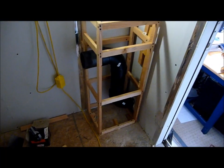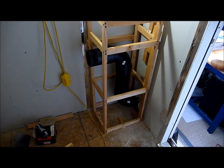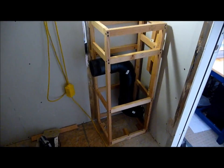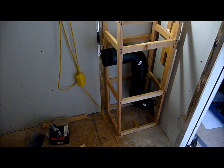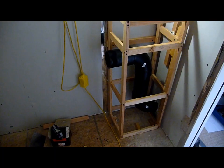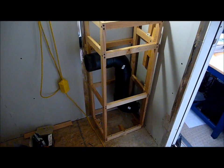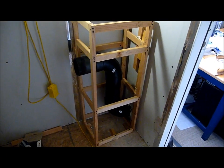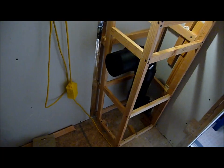So what I've done here is I've taken some 4-inch PVC pipe, fed it through the wall, and then through the use of some elbow joints, kind of snake this thing around. And this is going to do two things for me. One is it's going to provide a nice 4-inch wide conduit through which I can feed some cables. And also the S curve here is going to be providing some acoustic protection, because sound waves will have to travel through that structure in order to affect my recording. You might ask, well, why did I decide on 4-inch?